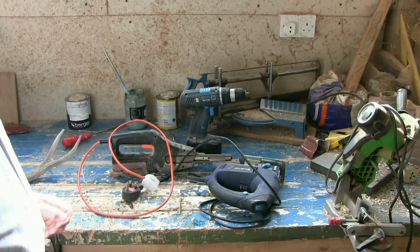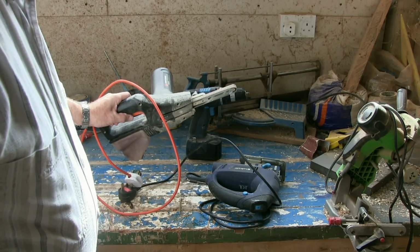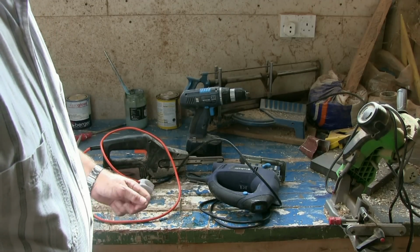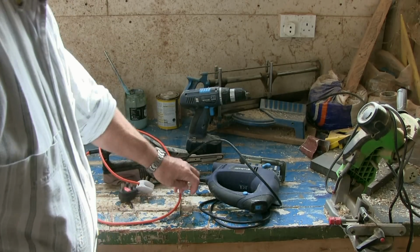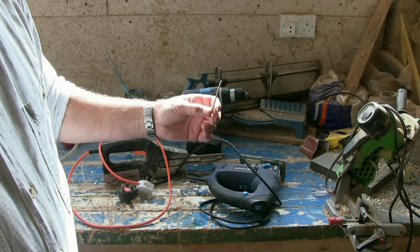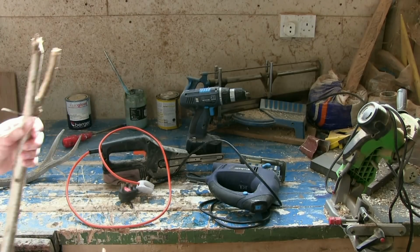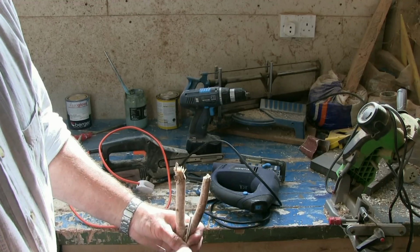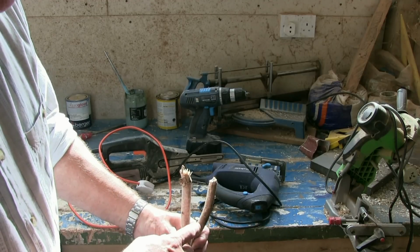Right, what tools are we going to need? Well, if we're going to use power tools rather than hand tools, a jigsaw to cut the end of the piece of wood off, to cut the bone, this rather lovely little sander, the belt sander, which will enable us to trim around the joint of the bone and the antler and the wood at the end, and the glues as well. Obviously a little drill here. I've got a 3-inch screw here, which is threaded all the way up. The idea being that when we come to the piece of wood to join it, we'll be able to put that screw into the end of the wood to about halfway. Take this off on the grinding wheel, or you can saw it off with a saw. You could then use a file if you want, but use a grinding wheel to point it up again.